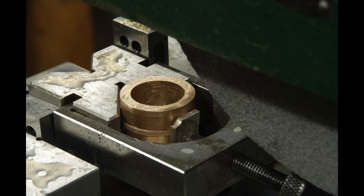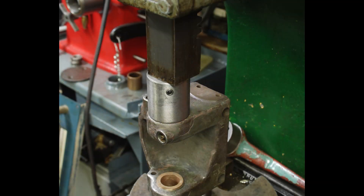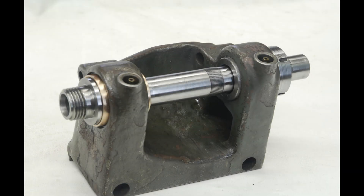Any force on the work pulling it out of the headstock is taken up by this surface and a washer that goes between it and the pulley. The fit between the shaft and the bearing seemed to be pretty good so I went and pressed the bearing into the headstock. The interference fit was so minor and the casting pretty sturdy that I was able to do it without busting anything. At this point we really don't know what the true axis of the outboard bearing is, but I thought I'd be able to use it as a guide on the shaft and then use the shaft to spot the inboard bearing and scrape it into a perfect fit.